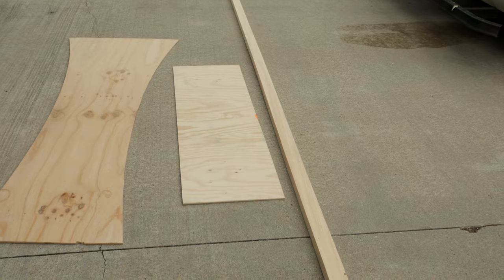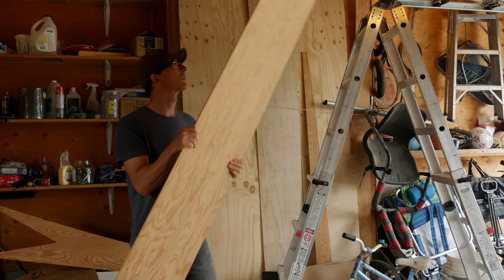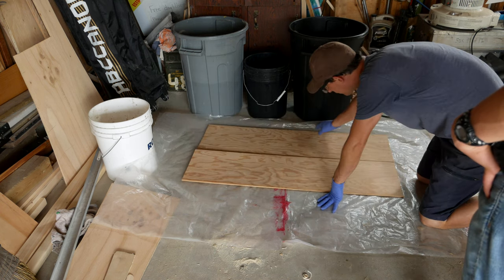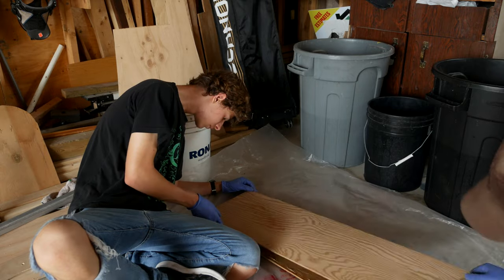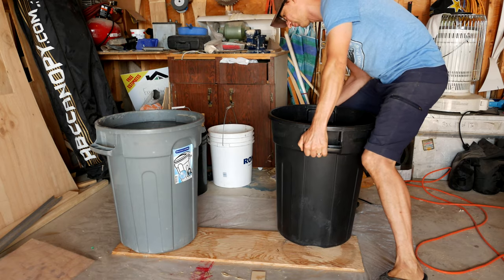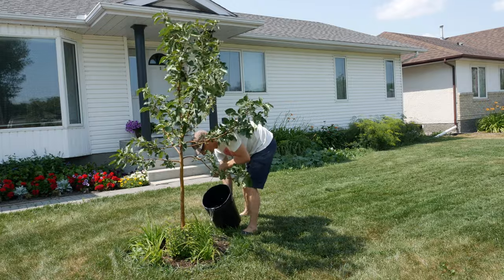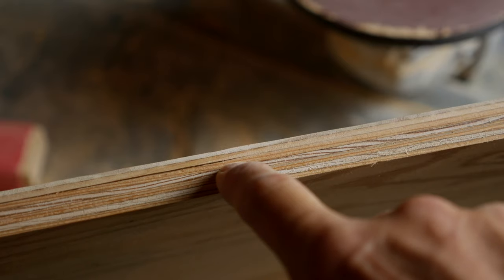This is the plywood we had left over from our original three sheets. We wanted a three quarter inch thick leeboard, so we used those two plus one I had left over from my quick canoe. We decided to glue them together just like we did for the top of the rudder, one at a time rather than all three at once because we weren't sure how well we'd be able to clamp them all together. We spread lots of glue on one side, put the two pieces together, and then set a bunch of garbage cans and buckets with water in them on top to clamp them down. Our second board didn't glue up quite as well because I think we just didn't have enough glue on it. With our leeboard glued together, we cleaned up the edges on the table saw, which made the gaps in the glue-up pretty obvious.